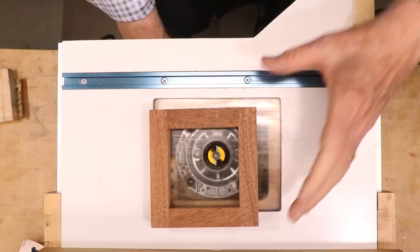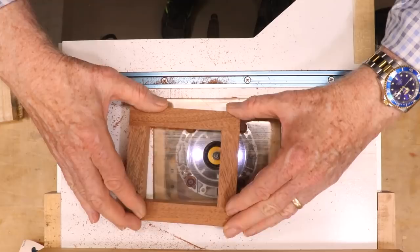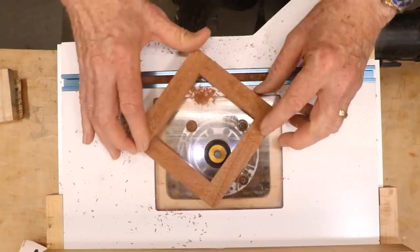This square frame is the front of the light tight portion of the camera. The bellows will be attached to the back of this frame. In it, I cut a recess, which will hold the lens board, which in turn holds the lens itself. Vertical supports will allow this lens support frame to tilt, move up and down, and rotate around a vertical axis.